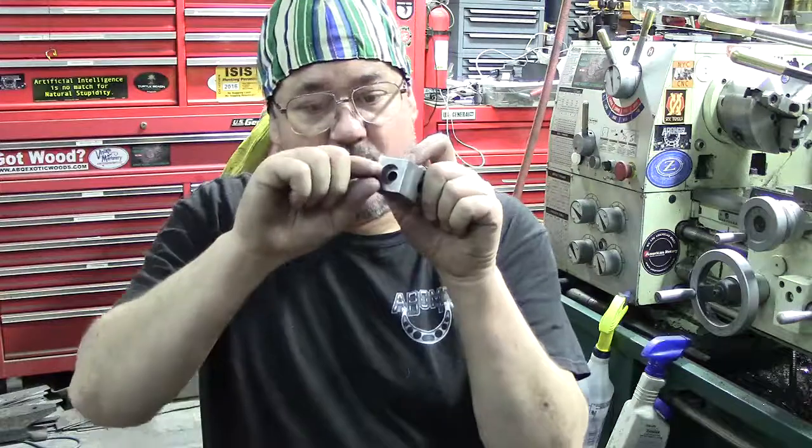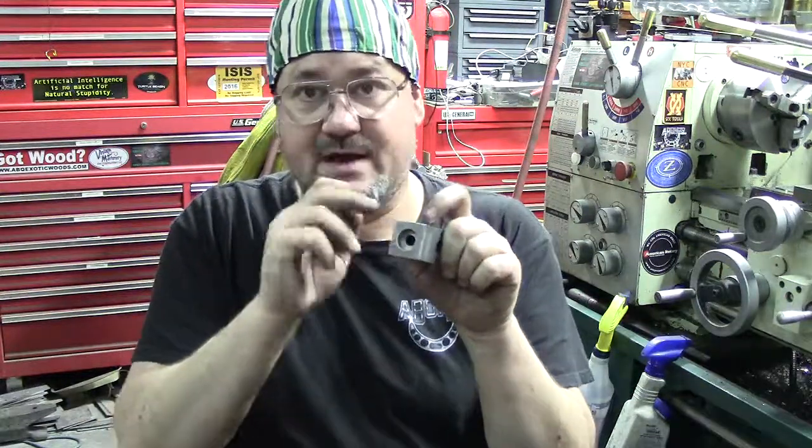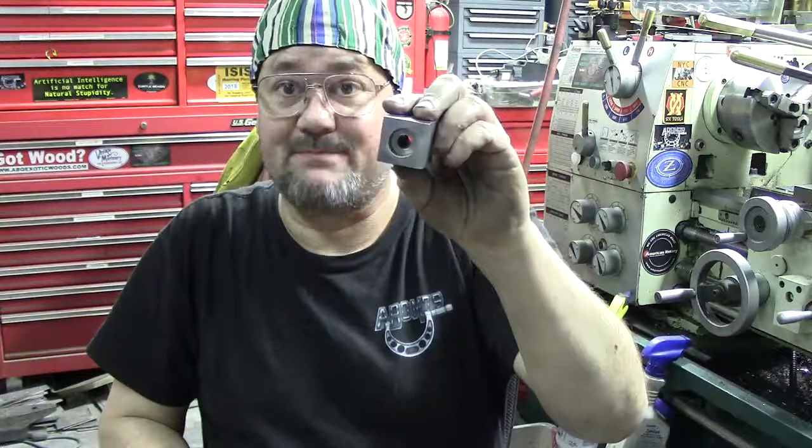So we had oil bypassing, it was mainly the O-ring in there was bad. Now this is what I've been able to tell, this surface grinder was built in 1962. So I knew when I got this it needed work, not a problem. It was just in the process of getting everything together, and after I went through it, it worked fine, and I probably put about 100 hours on it, and then that's when this started leaking really, really bad. I was using it hot and heavy. So, and that's fine. As far as I can tell, these are all new.